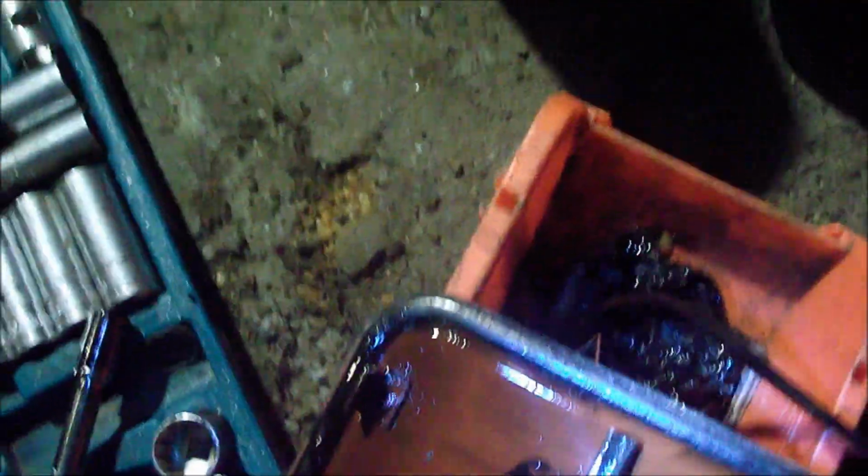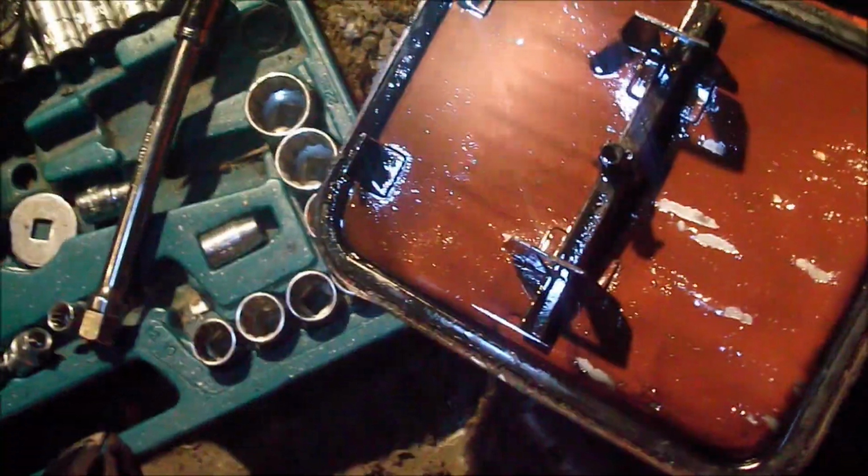Well, I've got the engine apart now and got the back out. The governor's in there, pretty gummed up with oily gunk really. That's the crankcase door. It's quite a lot of original paint, and inside the crankcase, if you can see, it's like new. I don't think this engine's done a lot of work, if I'm honest. It hasn't been apart before because the gasket is completely original. The bolts still have paint all over them, and obviously due to having the transfer on there, the engine hasn't been repainted and it's completely original.